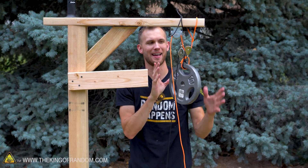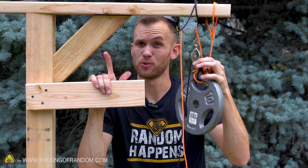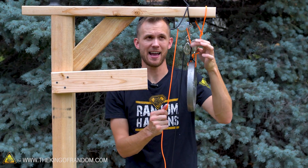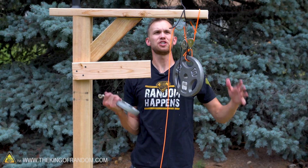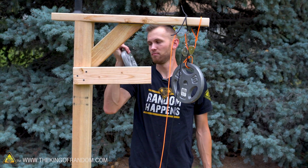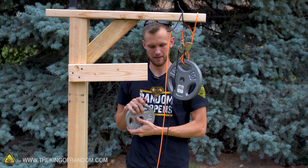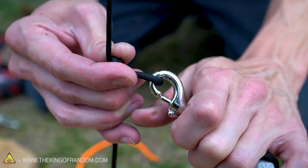We have our system all set up. We've got a 10-pound weight with two separate pulley systems attached to it. The black one is a single fixed pulley — it's not changing the magnitude, it's still an even 10-pound pull, but it is changing the direction: the weight goes down, it pulls the rope up. The movable pulley changes the magnitude by dividing it in half, and the fixed pulley changes the direction so it's still opposite to the movement of the weight. Imagining this is a scaled-down treehouse, the 10-pound weight represents the counterweight, the 7-pound weight represents the person, and the little ledge represents the treehouse platform. The black cord is on the fixed pulley and is currently tied to something on the ground — this little loop is where the person grabs hold.